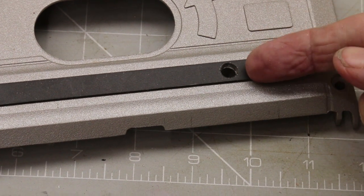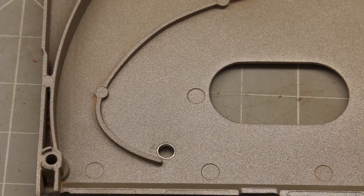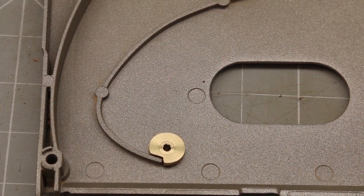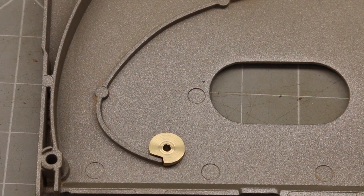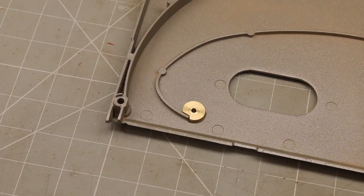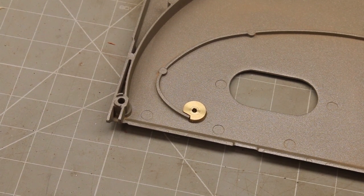Drilled through the centre of the rubbing strip, a 7mm hole comes out here on the frame. My brass bush fits over the nose of the dust collecting strip. I believe this will enhance airflow rather than detract from it. It also locks the bush and prevents it from turning. Though it was a tight press fit in the hole, I enhanced it with some araldite. I don't want this to move.